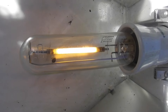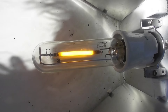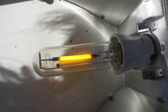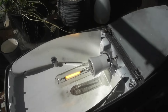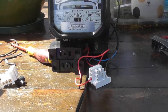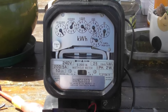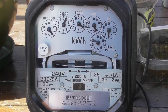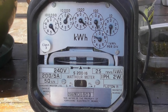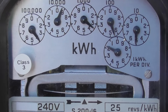So this is a 150-watt bulb sitting on about an 80 VA ballast in the OptiSpan — these are normally designed for 250 watts. It's a very dodgy setup. There's a 5-ampere fuse. I've got a check meter in — it's a Sangamo S216, actually a CT meter but with a higher speed, so the dials will advance quicker on this device.